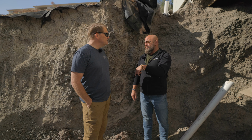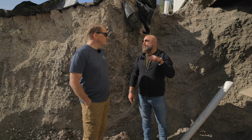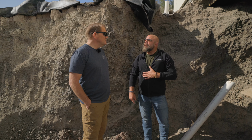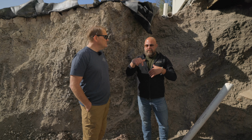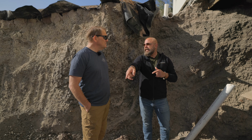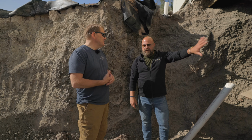And actually, it would be important as a home builder if you decide to take on a project like this to watch for some very important things. The engineering of where those pillars were to go was never done. The surveying wasn't done. So previously, it was just basically, just put it there and put it there. And so you can see why inside there were some mistakes.